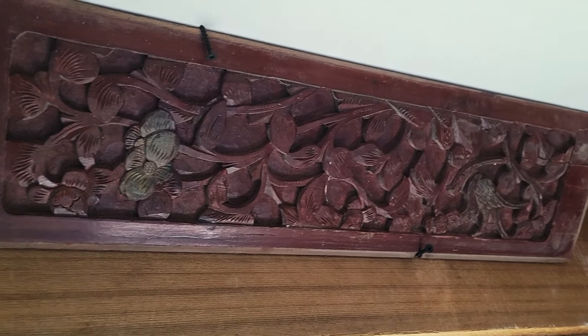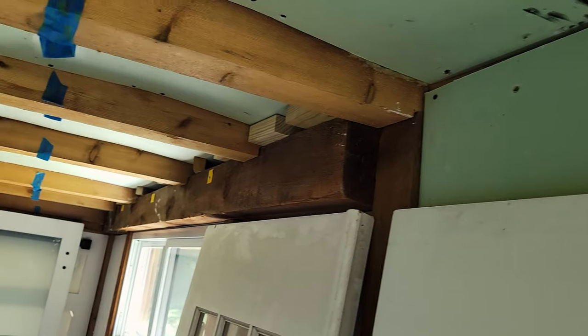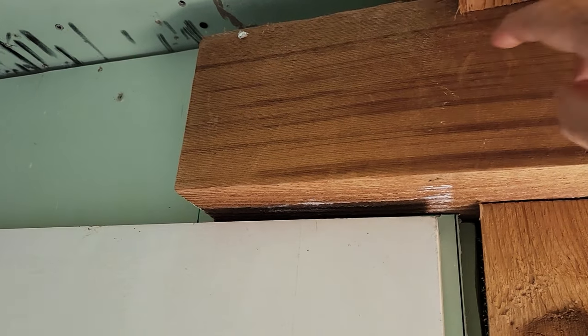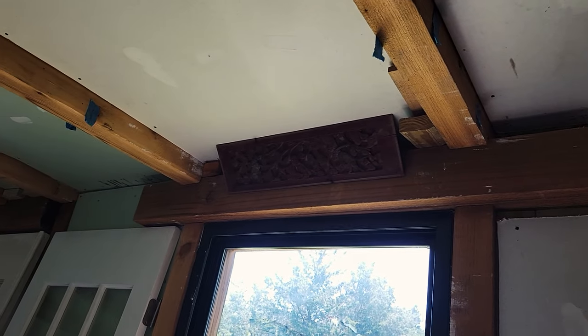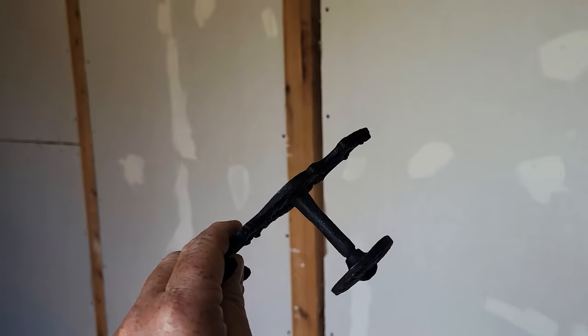Now the little wood carving panels - they all have different patterns. Between the roof and the cedar post there's a gap about an inch and a half, and my idea is to cut these down and tuck them up in there so there's an interesting pattern all along the top. I'll do a little 45-degree bevel there otherwise it'll just be a spot for dust and spiders. I'll make a crown all the way to the ceiling - more or less, we shall see.